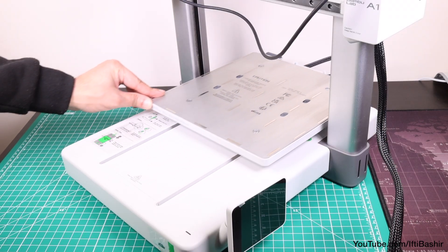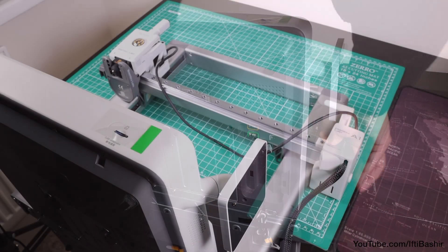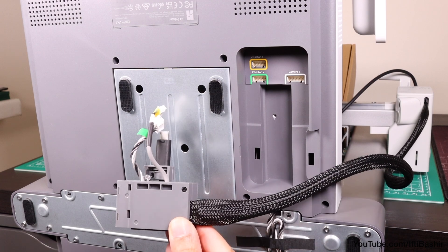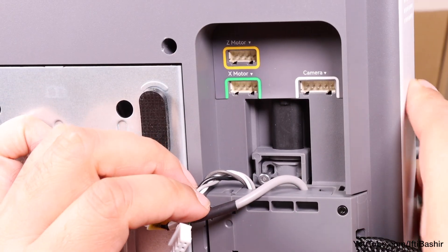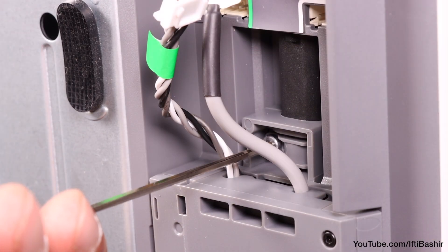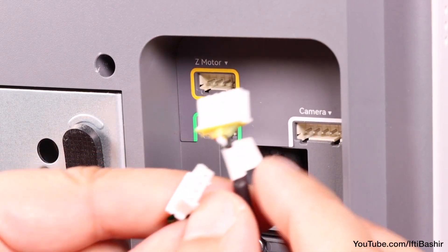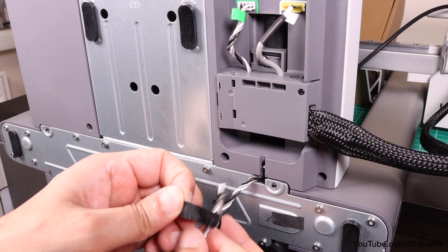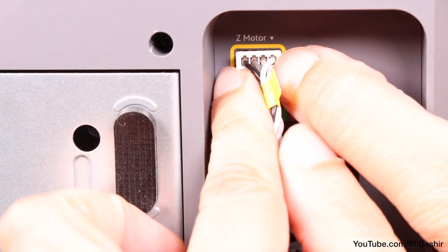Electronics next — push the bed all the way to the back again. Rotate and place the unit on the edge of your desk so it overhangs, and to be safe, place some weight on the top end to ensure it doesn't tip over. We're now free to plug in the cable box into the right side of the bed carriage — place into position before pushing upwards so that the USB-C connector pushes up into its slot, and secure by tightening the single pre-inserted screw. We have only three connectors to plug in here, each colour coded. The third connector, located further down, routes through a side panel in the cable box and up to its respective port, again colour coded for ease.